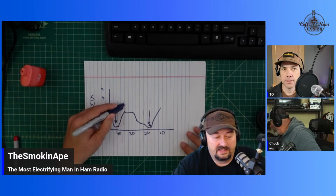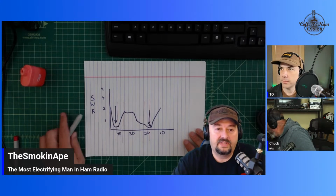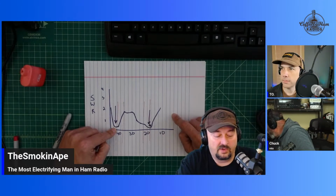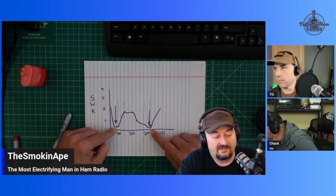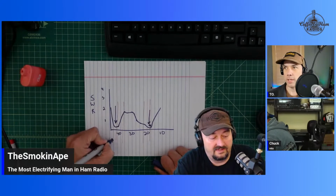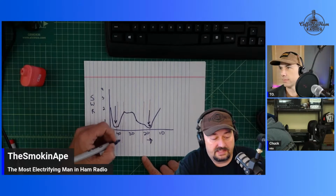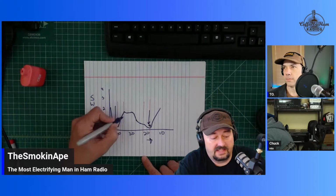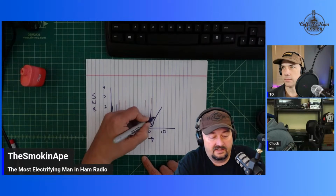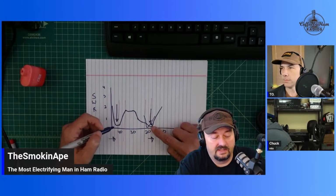Say these red lines represent the 40-meter band, and the red lines here represent the 20-meter band. The worst thing that you can have happen is you have your lowest part of your dips just lower than 40 and just higher than 20, right? Because if you cut the antenna shorter to move this dip, then 20 is going to move further out, and that's why sometimes you'll see people put those compensation coils in here. Actually, a compensation coil will make it a little bit longer. But what they'll do at that point is they'll just cut this end here until 20 is where you want it, and then compensate this end right here. Is a way to do it.